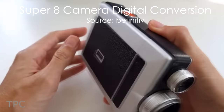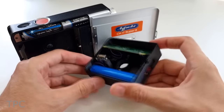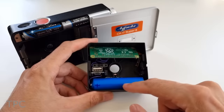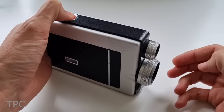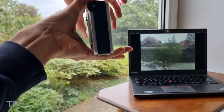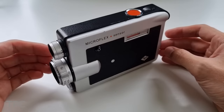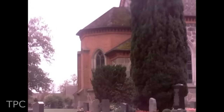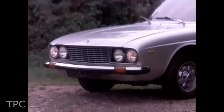The Super 8 camera was one of the spectacular video recorders of its time, but this model is harder to find now. This project modifies that antique hero to work with a Raspberry Pi. From the outside it looks the same, but from the inside the old housing film is replaced by a Raspberry Pi Zero, a rechargeable battery, and a power converter circuit. The camera starts filming when the user presses the red button. It uses the Pi camera module but still makes use of the camera's built-in optics, which include a zoom function. The camera can connect to a Wi-Fi network and stream live video to a computer, or record video files to an internal SD card.